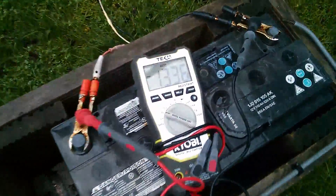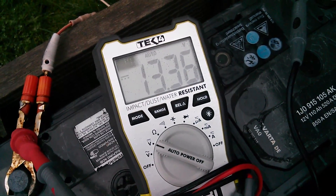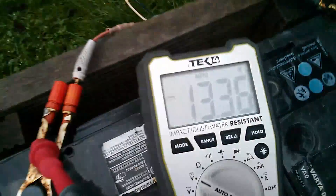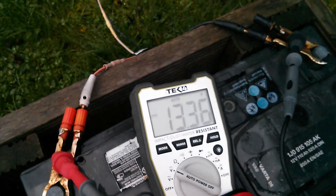I've put a DVM across the battery terminals and I'm getting 13.36 volts. When the charge controller is pulse width modulating, that would be 13.5. It's not far below that — so is it sort of partially working?